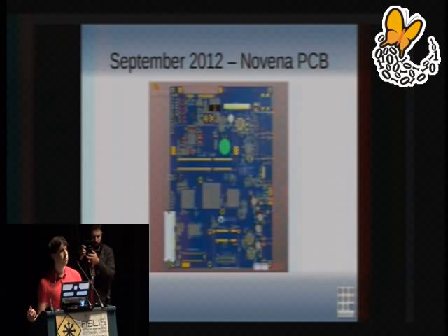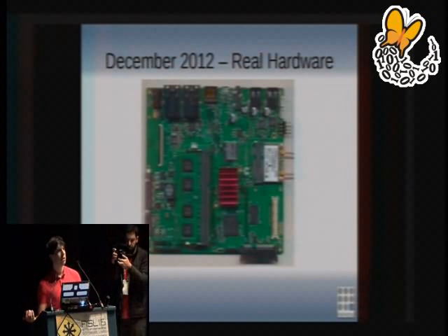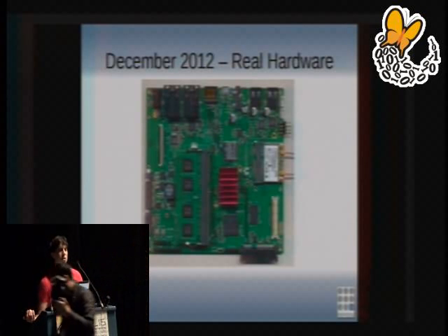Here's a 3D picture of the board — most schematic and board layout software lets you do 3D, and it's nice to visualize it before you can actually see it. So September 2012, we have the board laid out. December 2012, we have first hardware. It's all populated, comes from the factory. We put in a boot card we'd made ahead of time, and the thing actually starts up. We got really lucky with the RAM timings and got a boot prompt. It didn't boot all the way because we hadn't written the drivers, but no smoke came out — and that's always a good sign.